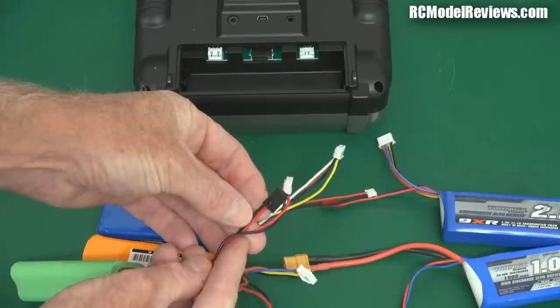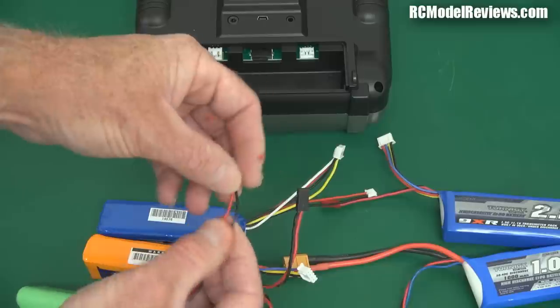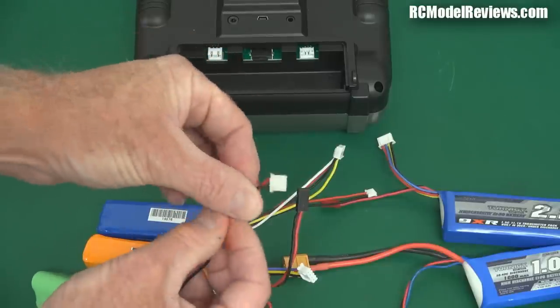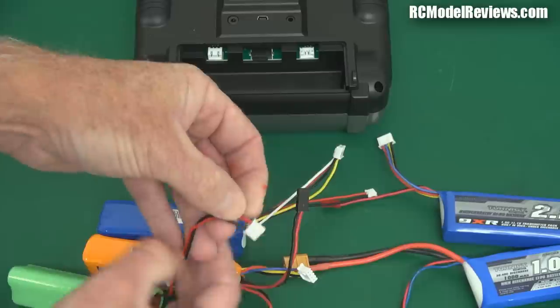Taking great care of course to connect positive to positive and negative to negative. But even then I'm not that keen on it, because it's got these horrible plastic wires that don't flex — they cause a lot of stress on the base and it's easy to get a fracture in your wiring there over time.